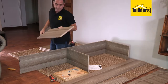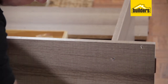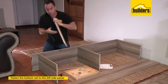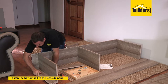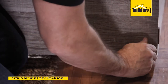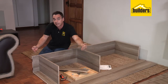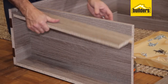Exactly the same process with the next fixed shelf — push that in, add in another two director screws from the other side. Moving on to our base shelf: line it up again, peg hole, put in your director screw and then just tighten. We've got two rails, one that goes in the bottom. Line it up with the dowel hole, pull it in tight and then secure it again with the director screw.